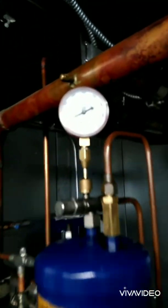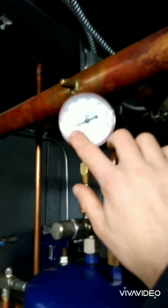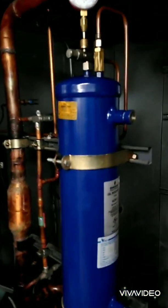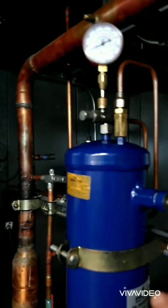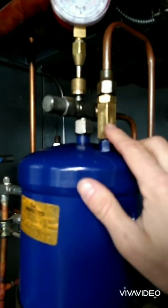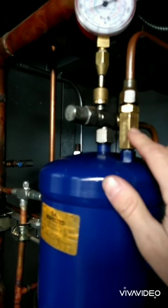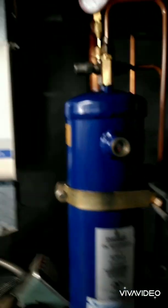Originally I couldn't get a good pressure on the reservoir. It's really blurry, but it's at 75 — we have a 52-pound suction, so that's good. I saw during different times that the reservoir pressure was equal to the suction header pressure. I changed the check valve; this was a 20-pound, but that was barely 8 pounds over suction. So I came back and put in a 30-pound check valve, and everything looked great after that.